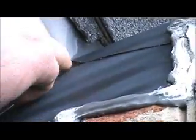Okay. See, right here, there is a hole in the flashing, which is allowing water to get right down along the chimney there too. So that just needs another shot of caulking in there. This side over here looks tight. Okay.